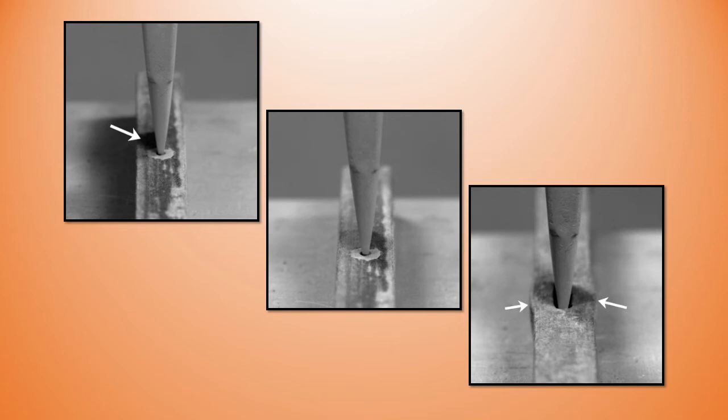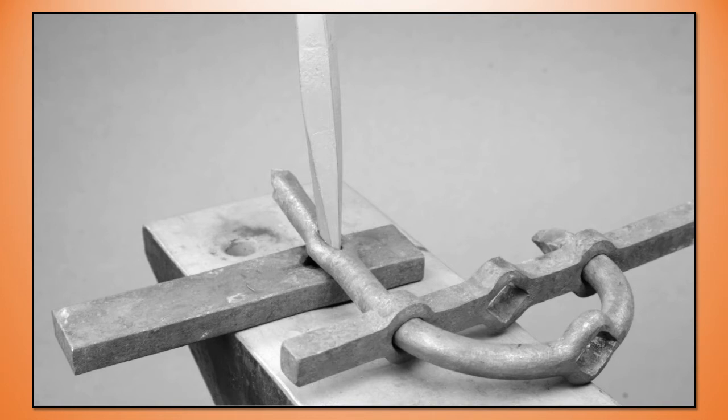Working in a strong light source can be detrimental to getting your punch in an accurate place. If you have any strong light source — from the roof lights, a window, or an open door — try and point your bar toward the open light source and that will help you center your bar. I typically end up crowding the shaded side when there's a strong light to the side. Most times I like to work along the bar; I work across the bar only for more complex forgings or when there's no other way.